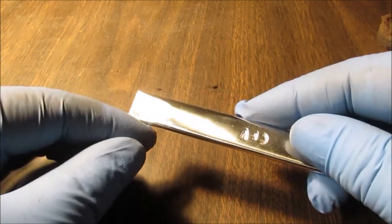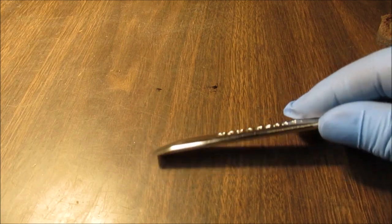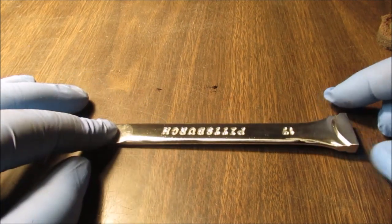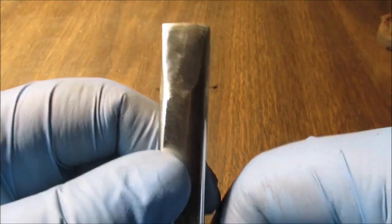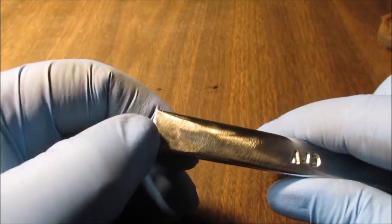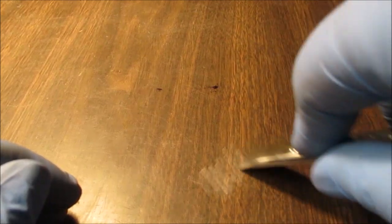It's not hard to make a chisel — it's actually a scraper. If you go in this direction you don't get much play. There's a small edge filed on here and it's not knife-sharp, because you've got to get it completely straight and this is never going to be perfect. So this tool is for scraping gaskets and it might need a little more work, scraping all the stuff off the table here.